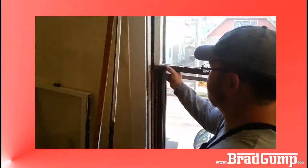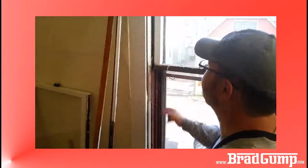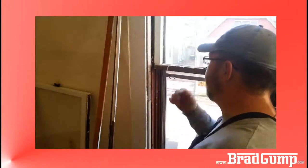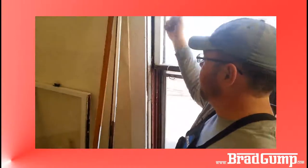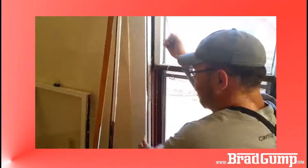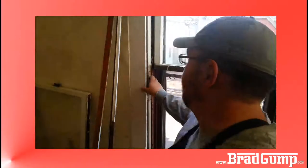So that's it for that side. As you can see, this comes real loose at this point. I'll remove the other side and then the top sash will come out. The top sash also has sash cords and pulleys, and inside this cavity here are weights that hold the window in place — hold it up in the summer so that you can get fresh air.